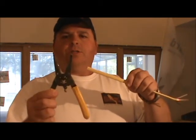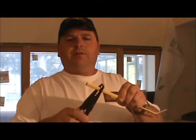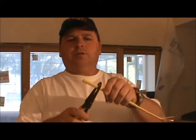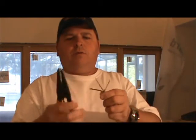This set of wire strippers is limited to 2 gauges of wire. It has 12 gauge and 14 gauge, which are the most common inside your home. So we're going to take it right to the very beginning here. This is our strip gauge for our Romex. Give it a little squeeze, a little twist, pull it off, and now we have the wires exposed. Peel back the paper insulation on the ground, and we're ready to strip the wire.